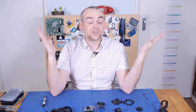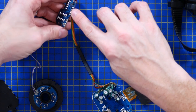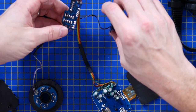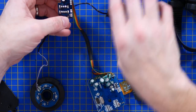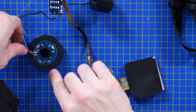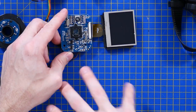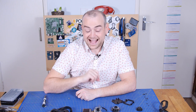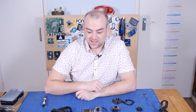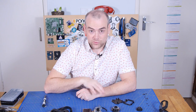That 7.5 volts does appear to just go straight through this switchboard out to the LEDs. The LED arrays have both got resistors built into them, so it doesn't matter too much. But that must mean either the screen or the camera module actually wanted that 7.5 volts, which strikes me as strange. Without knowing what this glop top ASIC is, we'll have to assume there's a good reason for it. This may seem like a very simple hack of existing hardware to make something seemingly way outside its original purpose, but I think this technique is super cool and obviously there are lots of uses for it.